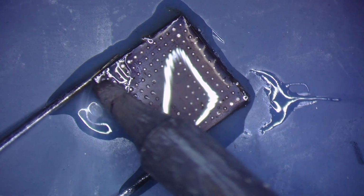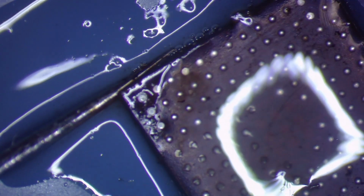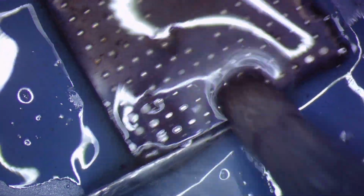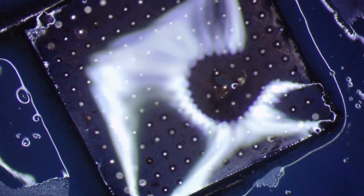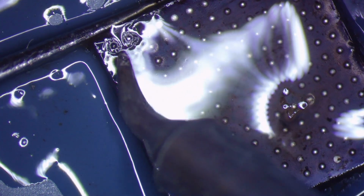So you want to get these oxidized pads, just so you guys can see what I'm talking about. These pads that are kind of grayed out. Are you in focus? There we go. And if they're being stubborn like that, the couple of these that we have here are, then we're going to go back over them with a smaller iron just to make sure they respond properly. All right, let's grab our, I think the micro pencil is what's plugged in. So that's what we'll be using. And you'll see I'll just go over each one and they will come right back to life just like that.